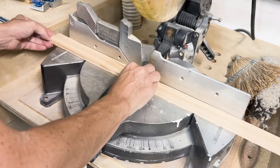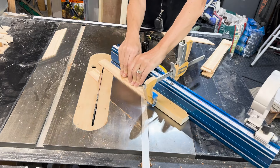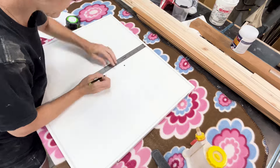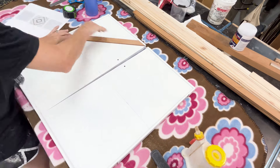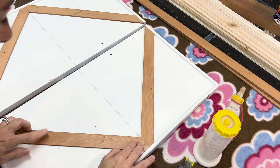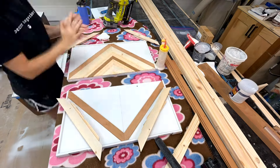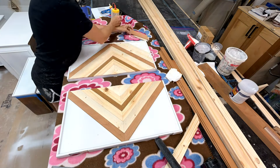Now it's time to start laying out the patterns. It was easier to cut each strip at a rough length on my miter saw, then make the angled cuts on my table saw using the miter gauge set at 45 degrees. I wanted the doors to be as symmetrical as possible, so I started by marking the vertical center of each door, placed the first slat, trimmed it to size, then used that slat as a template to make three more. The only way I know how is to individually measure each piece, trim, and set it in place one by one. I'm using glue and brad nails to secure them — and stay tuned, because you're going to see a big screw-up in a few minutes.